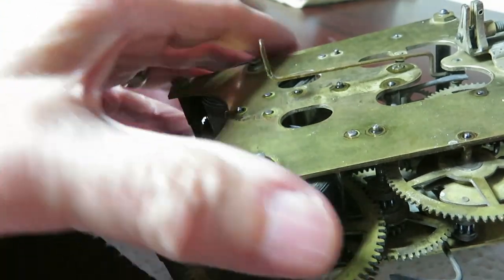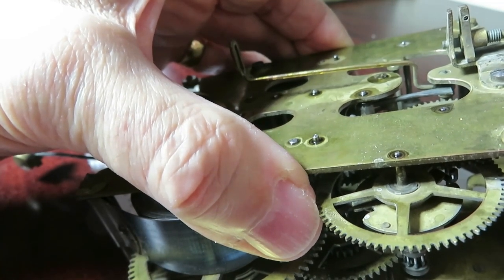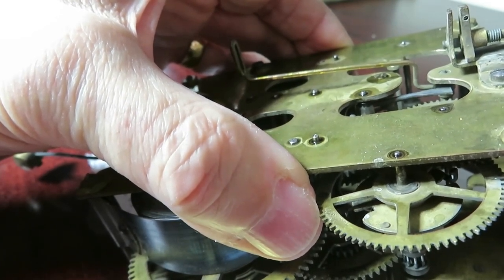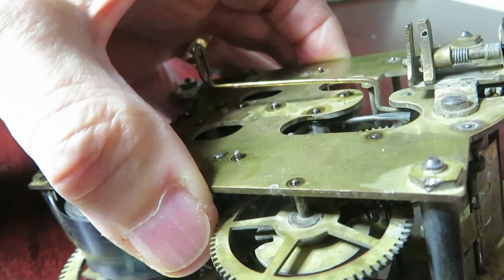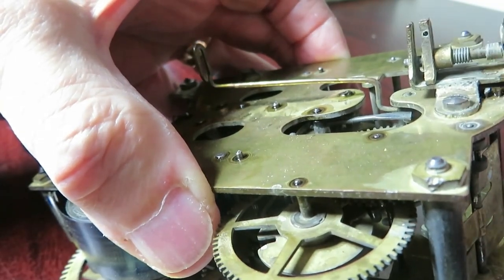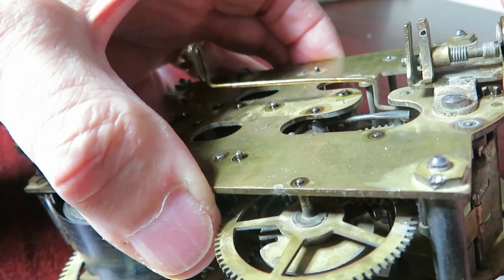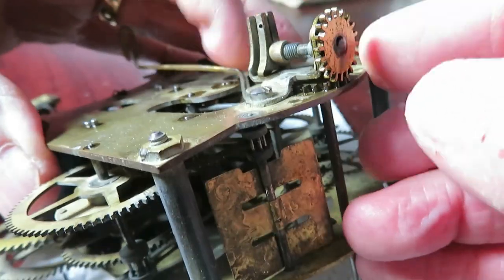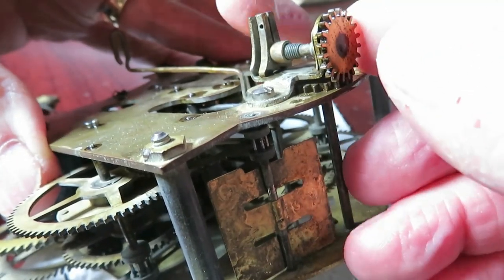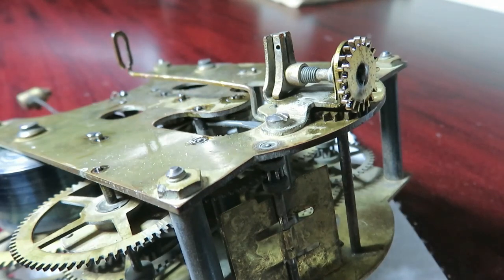This here is going to be a difficult one because it's got gears - maybe I should do it where the gears go together. I'm not putting too much on, just literally a drop. This is the adjuster that makes it go faster or slower - it increases and decreases the distance for the pendulum swing. I'm going to go through all of that, oil it all up, and then we're more or less ready to go back together.